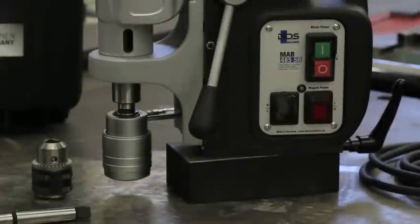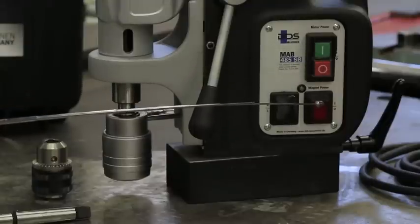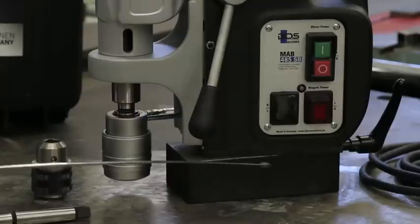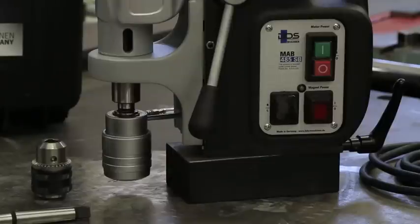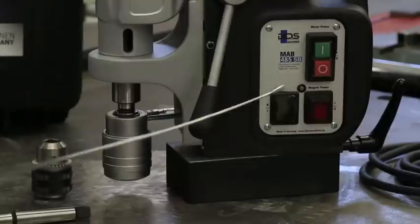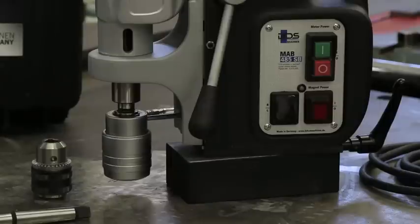Let's start with the control panel. First we have the on/off switch. Over here on this side we have the magnetic base switch. This big block is actually the magnet — when you activate this switch, that turns the magnet on, which affixes it to any ferrous material it's connected to. Obviously it has to be ferrous in order for it to be magnetized properly. Over here we have the direction of rotation switch. The nice thing about this mag drill is that it can rotate in both directions — a feature that enables you to do tapping as well. So a great feature.